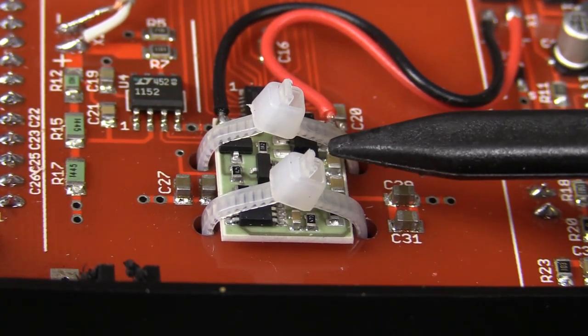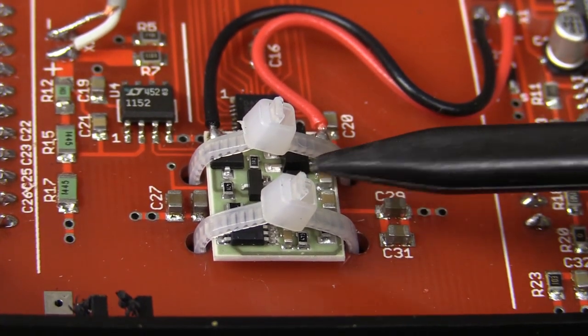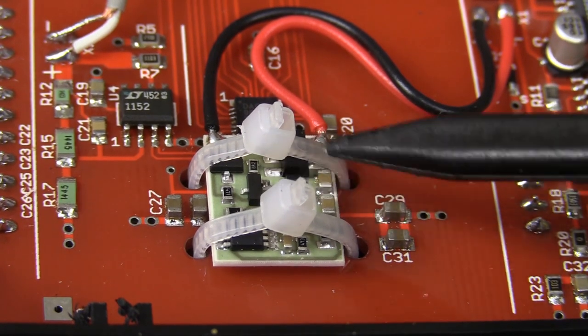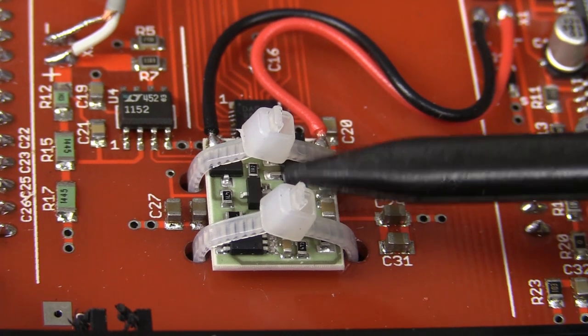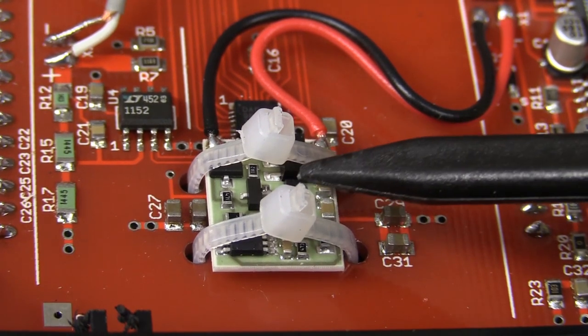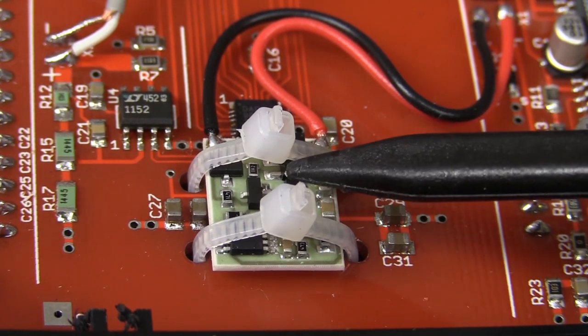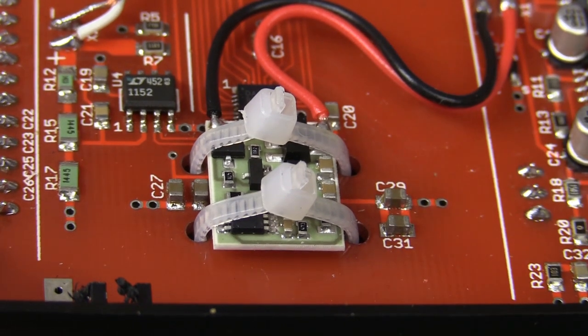And then I reckon there's a power resistor, an SMD power resistor, on the bottom of this double-sided board. That's just an LM358 op amp, so we've got some transistors there, and it's just for a loop to keep the temperature stable. There'd be a temperature sensor on the bottom of that as well. And I reckon that resistor is on the top of that chip, and he's cable tying them down like that.